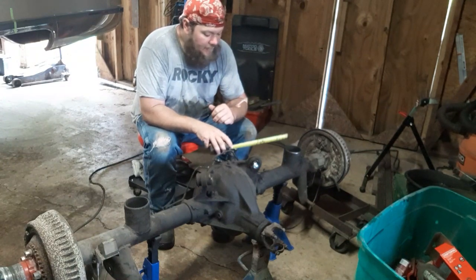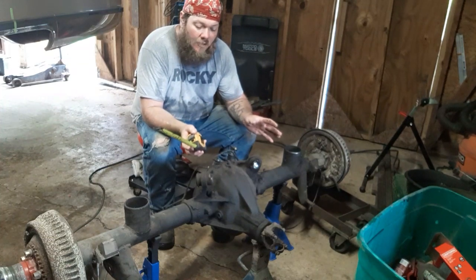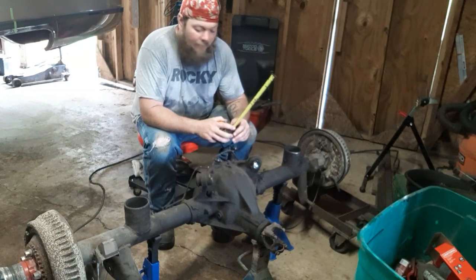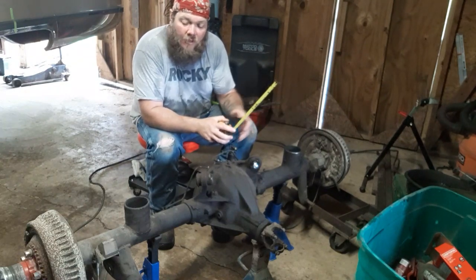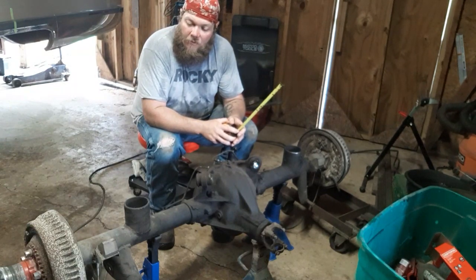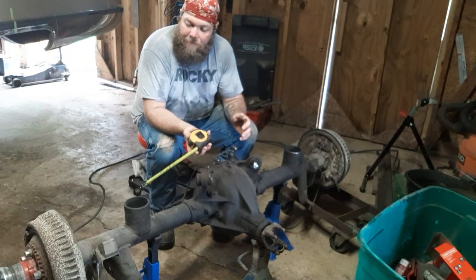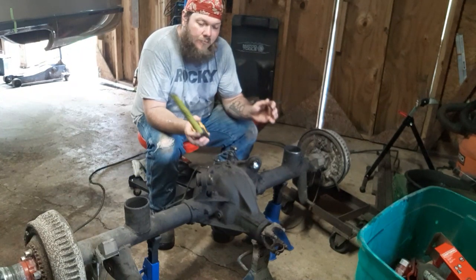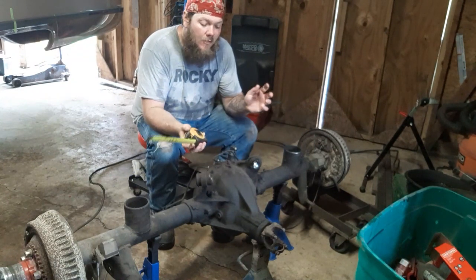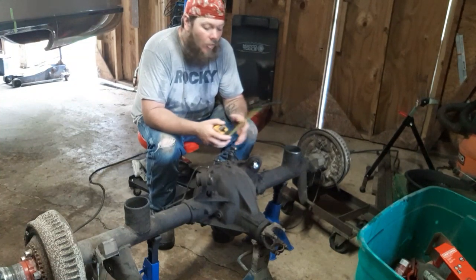So I'm gonna start cutting these off, kind of laying out my reinforcements, start tacking stuff together. I gotta see if I need to basically shim my power balls any certain way or not. I'm not sure on that. I want to be sure that my power balls have full range travel back and forth, all the way down, all the way up, three wheeling. Make sure that the cylinder isn't going to get in a bind at all.